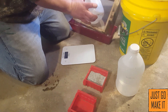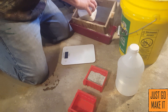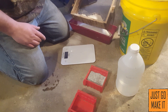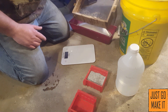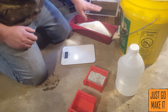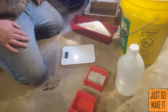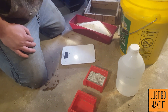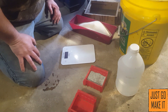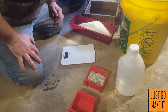Now if you're going to use silica sand, let me give you one little word of caution. Have you ever heard of a disease called silicosis? Silicosis and silica sand go hand in hand. The dust from silica sand will get into your lungs and it actually acts kind of like glass — it will not come out, and it causes a respiratory problem called silicosis. So you should be using a mask, and keep that in mind when using silica sand.